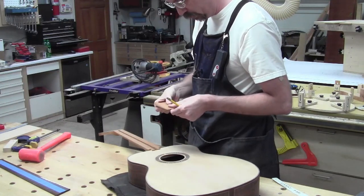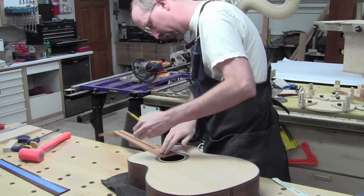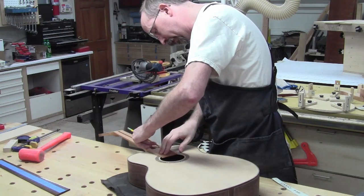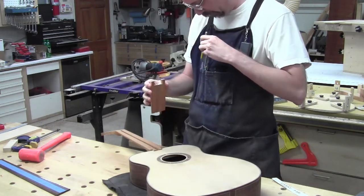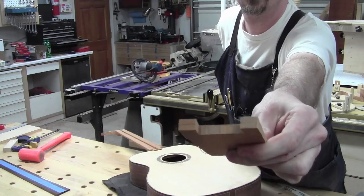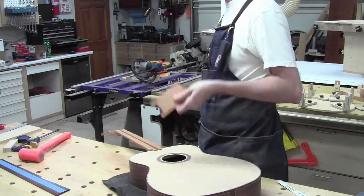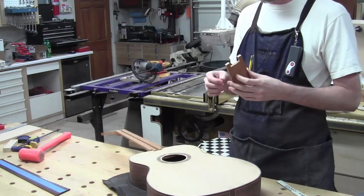So what I'm gonna do is I'm going to cheat my butt off, and I'm gonna make a mark right here and right here. And I've got about half of its thickness to remove. See the lines? So I'm gonna cheat and cut that on the bandsaw, because if I wreck this, I've got plenty of scrap. I'm gonna cut some of that off on the bandsaw.